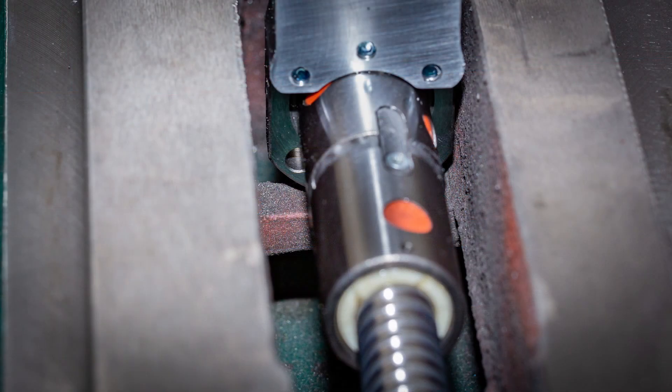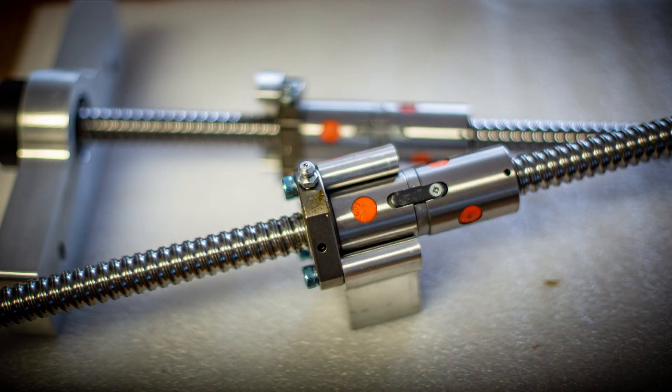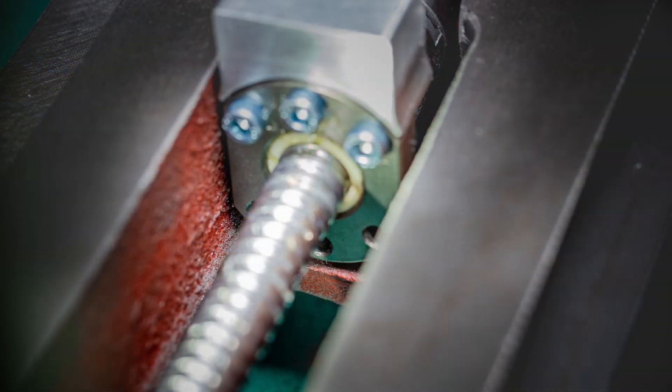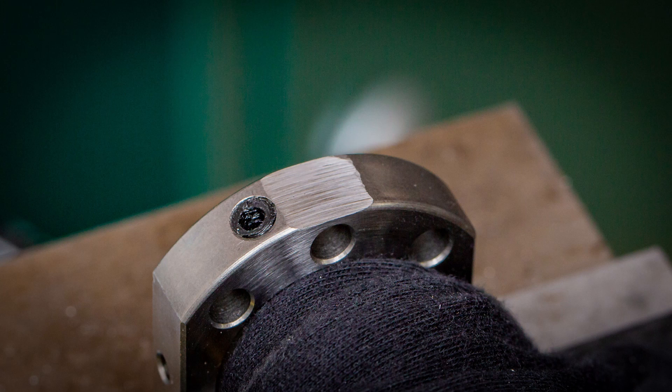The next order of business is dealing with the clearance for the cross braces at the bottom of the casting. I laid the mill over to get a view of the bottom of the casting — here you can see the cross braces. The ball nuts come with a grease fitting installed but there's no clearance for the grease fitting once the assembly is installed in the mill. I 3D printed some shallow six millimeter screws just to plug the hole where the grease fitting was, but as it turned out the clearance was so tight that even the one and a half millimeter screw head hit on the casting. So I 3D printed a six millimeter allen screw instead, oversized slightly in CAD so it was self-locking. I also decided to shave about a millimeter off of the ball nut — it wasn't actually necessary but I had the grinder handy.